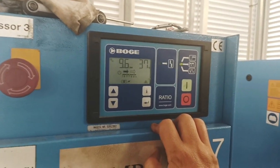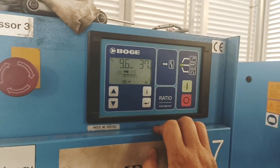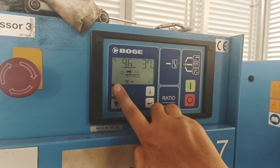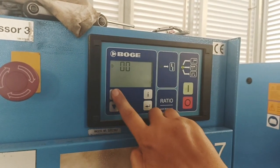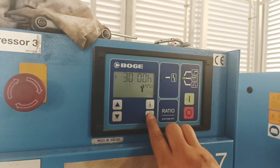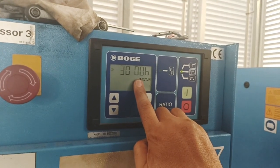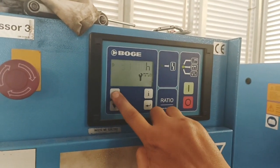Error 11 means your service is due. After you have changed the oil, the filters, and whatever else, it doesn't go away automatically — you need to do a setting. From here, go to the version page and enter the code 1-1-1. When you go to that, you will see the interval already set in here.